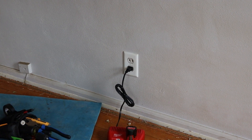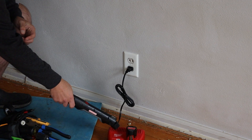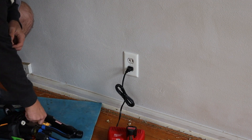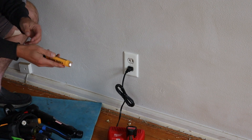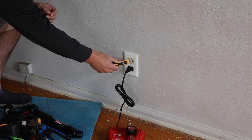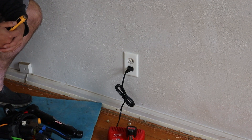What we've done right now — I have a battery charger plugged into this outlet and the light is on, so I know it's a hot outlet. I'm going to take my non-contact voltage tester, turn that on. It's a hot outlet — it's beeping. So we're going downstairs and we're going to shut off the power.